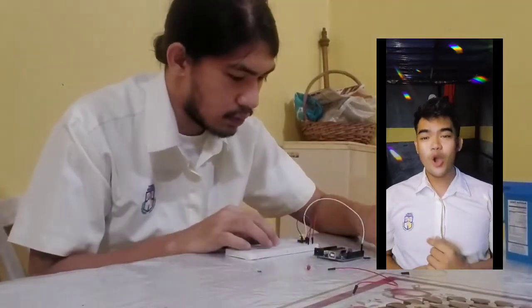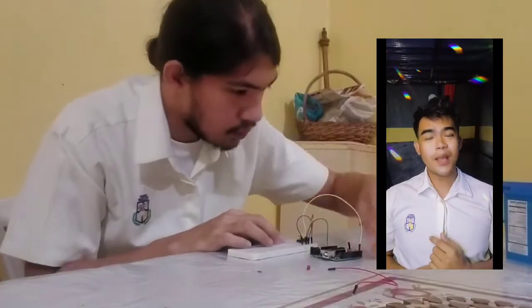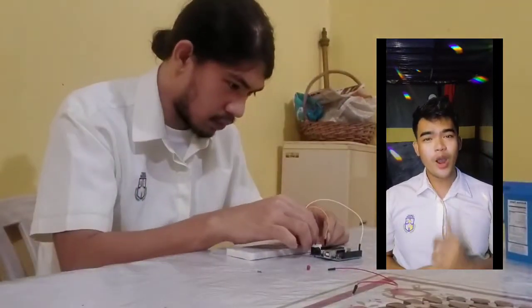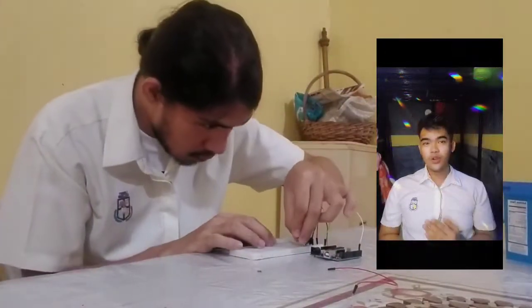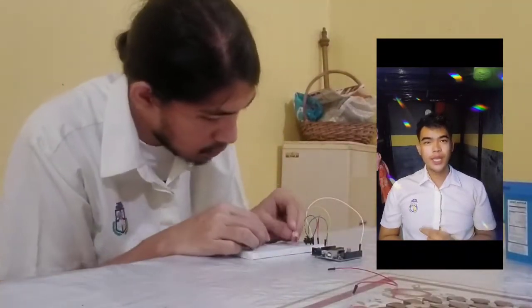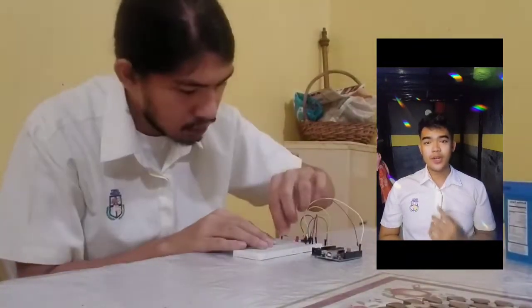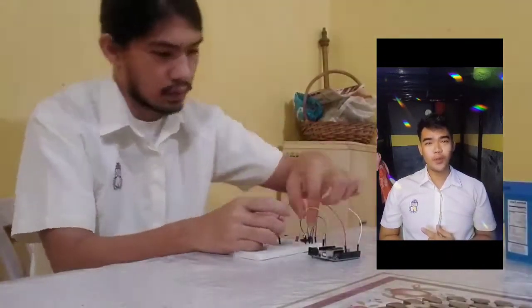Connect pin B on the switch up to the positive 5V rail and connect this rail to the positive 5V on the Arduino. Connect the longer positive leg of the LED to Arduino pin 13 through a 200 ohm resistor and the shorter leg to GND on your breadboard.